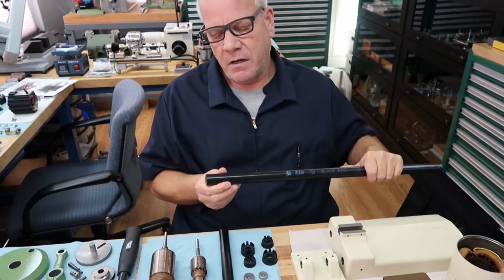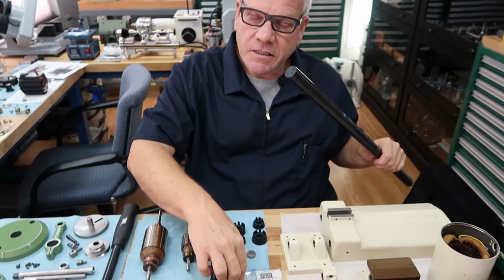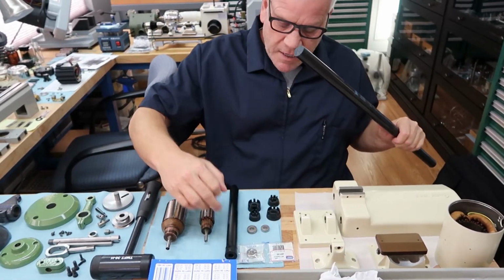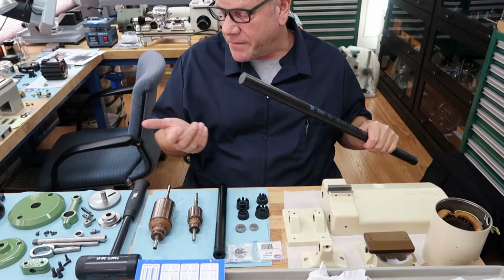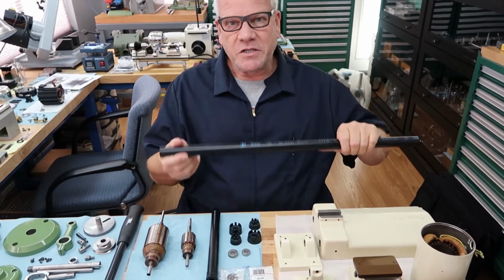You never, ever want to press a bearing from the outer race when you're doing an ID installation, on an internal diameter like this, and vice versa. You don't want to push on that center section if you're doing an OD installation to, say, a tight hole of anything you can imagine. So, yeah, it's real important, so the Delrin's going to save the day.